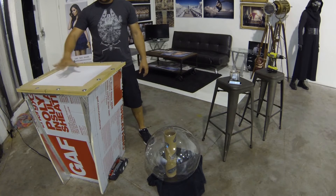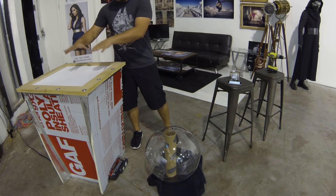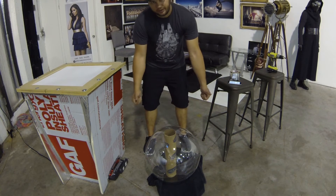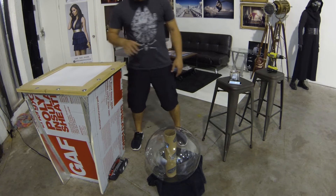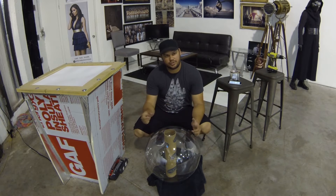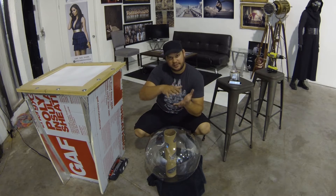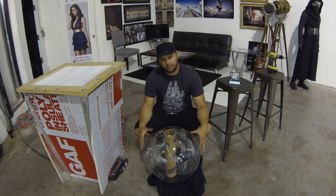After about two minutes and 45 seconds, or three minutes, it's going to be nice and bendy. Once I do that, I'm going to take it off, grab it, push it down on the ball, and hold it there for about another three minutes. What I plan to do is after I mold all my panels, I'll cut out six circles and eight triangles, then etch all the design elements into each panel so they'll actually be raised pieces. It'll look sort of like a 3D printed piece — not as detailed, but it's light, durable, and works for the purposes of this.